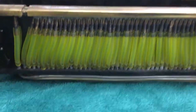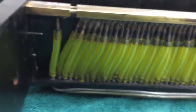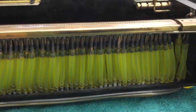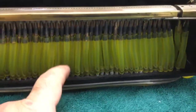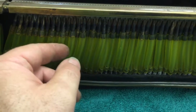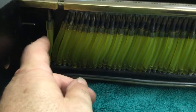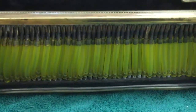This is Oklahoma Bridges. I'm back here and I've re-tubed the tracker bar on this player piano action. You can see I've used this yellow vinyl tubing — it's fuel line tubing, so it should last a lot longer than that original rubber tubing did.